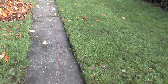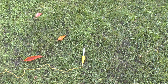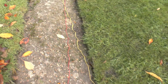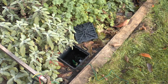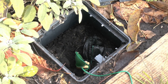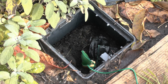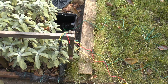And the yellow one I've placed about halfway along — you can see it's just placed here in the lawn. Same deal again: just press it in the ground and then the yellow lead clips onto the side there. That's roughly halfway between the electrode we're testing and the red one up there. Those leads come down to here, and in the box we've got the electrode which we saw in the previous episode. I've just connected the green clip onto that one, and there's nothing else connected to this because if there was we'd actually be testing that as well.